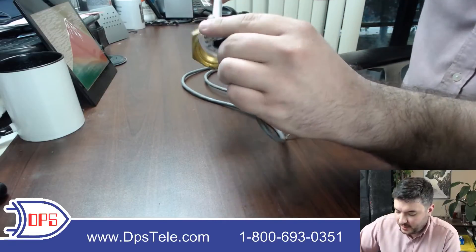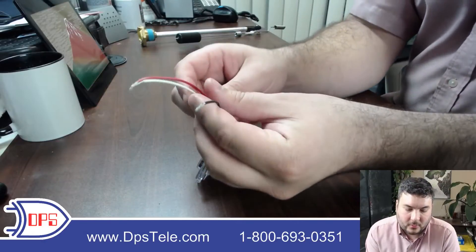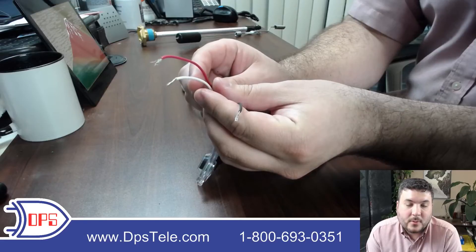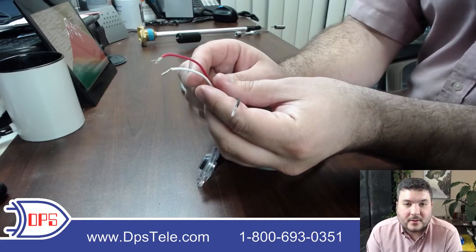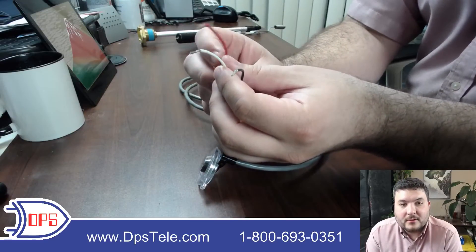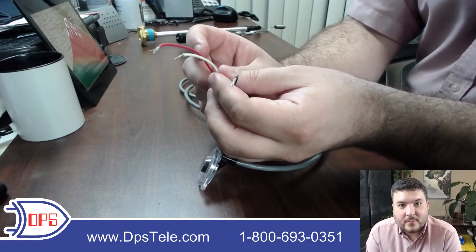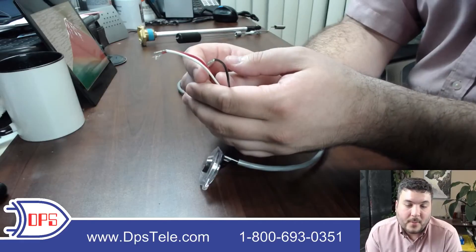The sensor terminates with a couple of wires. This is a zero to five volt output that you can run to a remote terminal unit. If your RTU has analog inputs that can accept voltage, you're ready to go. You would just set up the scaling so that zero volts is one level and five volts is another level, and that's going to translate from a voltage into a percentage of fuel remaining.